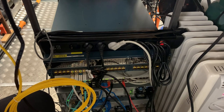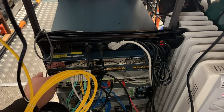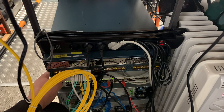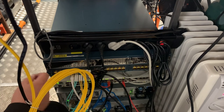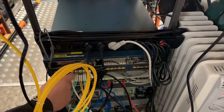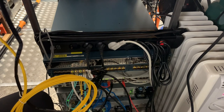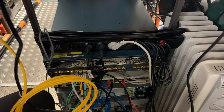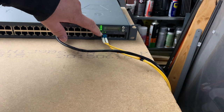But I did do a small change. These are always blinking hardware failure, even when I configured this. So what I did is I took a slot that I knew was working and it's not in use. So I swapped out the module. I moved it from here to here. And then it just became active. So now we see it's active and there's traffic.